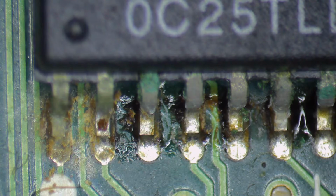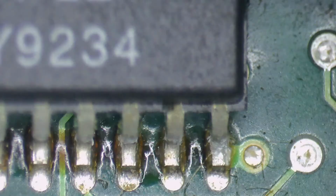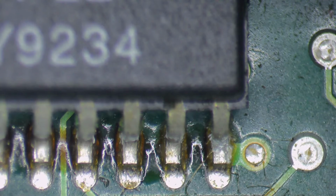The EMAC is not a bad machine. Some of them did have problems around the logic board and such, so it would not be a surprise if it's there for a reason, but it might just be someone's like, oh, this is old, I'm going to toss it. In that case, you could actually take out the logic board from an EMAC, ditch the CRT if it doesn't work, and you could actually plug it in to a standard power supply and a standard VGA cable. It's going to require some work, but you could actually do it. Okay. That's right, Adam. Thank you for refreshing my memory.